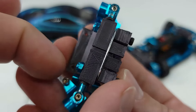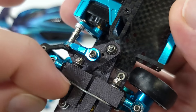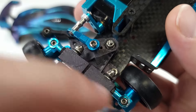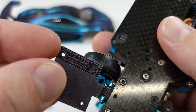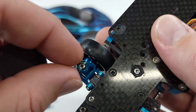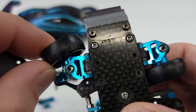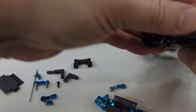You can use any little lock nuts and make it as long as you want. On this one, I originally made them to where I was going to have space in front and back to where I could shift it forward or back to give it some caster. But to be honest, I'm probably not even going to mess with that — I'm just going to keep it the way it is now. I was going to do the same thing on the bottom, originally making these little pieces that stick out about four to five millimeters wide so I could add washers on both sides to shift caster front and back. But to be honest, it was causing too much slop and movement in there, and that was affecting sturdiness. So I redesigned them to where they just fit perfectly in that space with no wiggle room anymore.